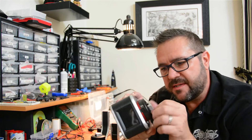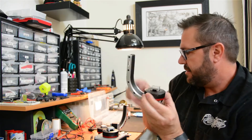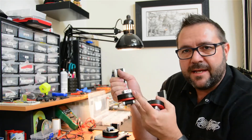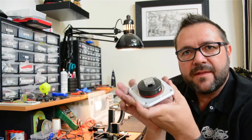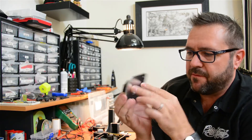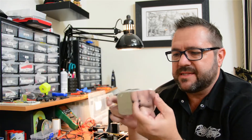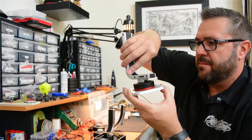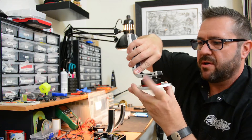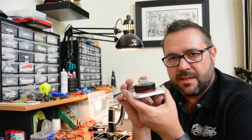Following up on the SteadyShotBot, we received the gimbal motors — you can see those here. I have one mounted to the top of the base, and I also mounted them to the arms. These are ready to be all connected and sort of fit tested. We have the gimbal motor and this block, which is responsible for routing the wires. These are 5208H motors — they have a hollow shaft which allows you to run the wires up through the center so they won't get twisted. There's a small cavity where they come out and navigate up through the arm. There are three arms and three motors, and they form the gimbal. This all gets screwed onto the top of the motor — it was all CNC'd with the Nomad 883.